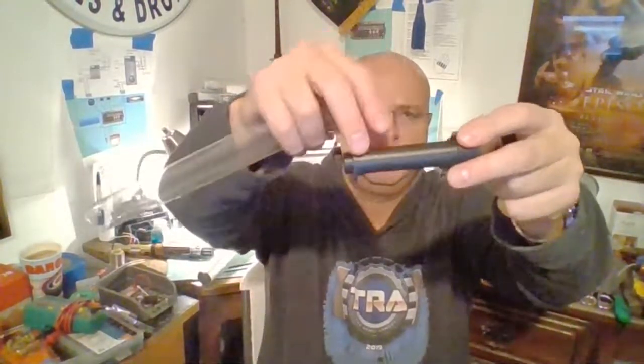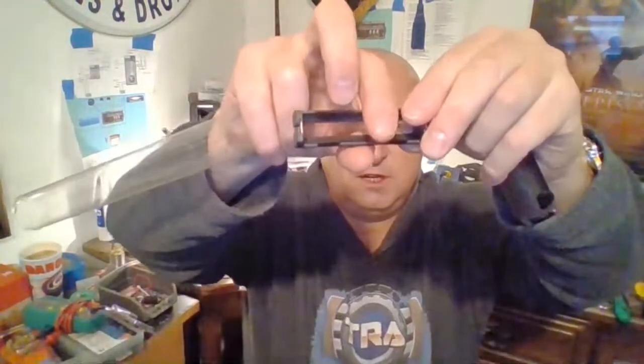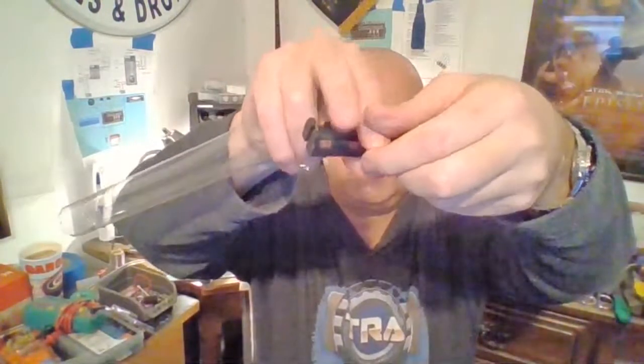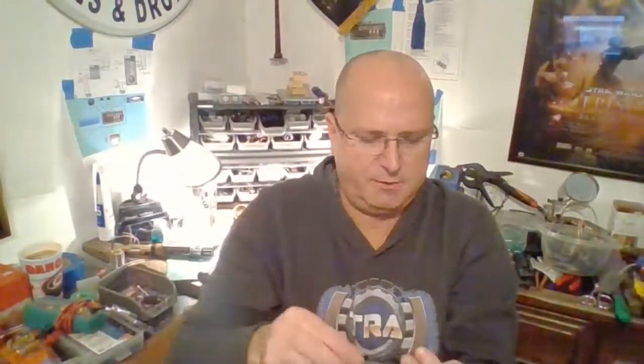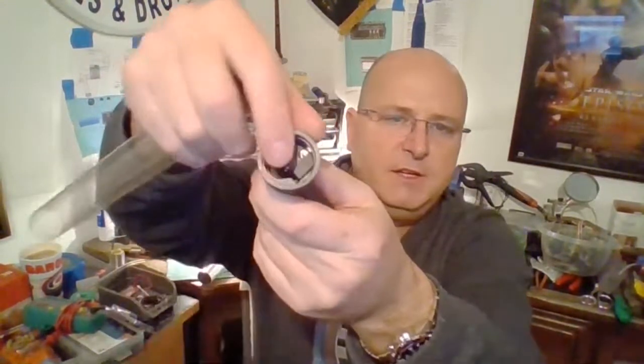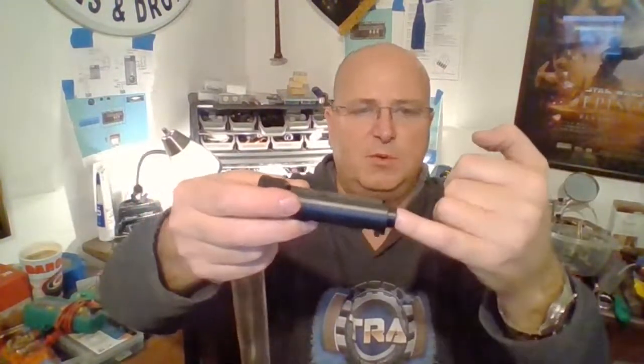I typically put some ribbon on this that goes underneath the battery, so you can tug on the ribbon and pop your 18650 battery right out of here. Now this also holds your speaker, so your speaker goes right here, and there are wire routes for your speaker, a negative wire and a positive wire, all in here. So then you just run all your other Saber wires from your LED module or your NeoPixel module and your switches in through here, and run them up through here and then onto your soundboard.